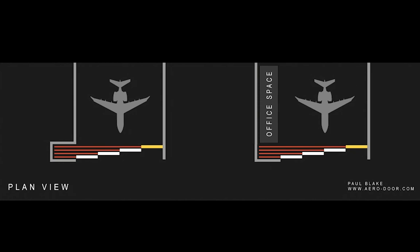To open the door the operator will stand here. He or she will hold down the open button on the control panel or the lanyard. As the first door leaf opens it will pick up leaf number two, then number three, and finally number four. It will then store inside of the pocket. Your hangar is now fully open.